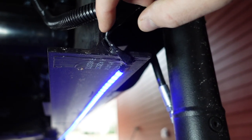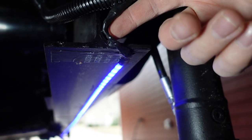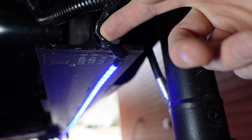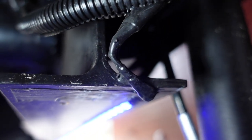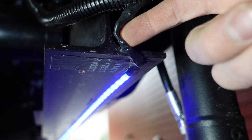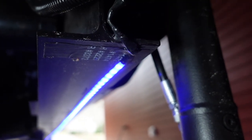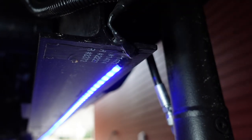I also came back and used liquid electrical tape — you can almost paint it on to the wire and build up a thicker insulation. That's what you're seeing, all this black that's molded around the wires. I came back with maybe two or three coats over time to thicken this connection up, making it more durable and resilient so that if something came in here it would be more protected.